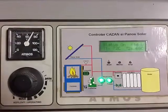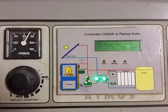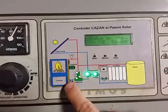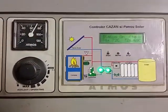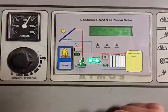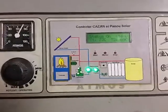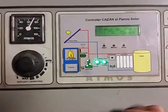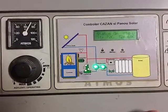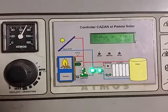As an important measure, the microcontroller is programmed to ensure a minimum water temperature over 65 degrees at the entrance, here at the boiler, to increase its lifespan and efficiency. It also selects the heat source — boiler or solar panel — based on the temperature difference, and shows the control element state by lighting up some LEDs.